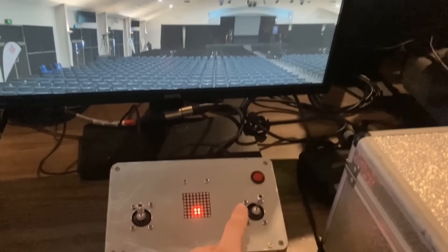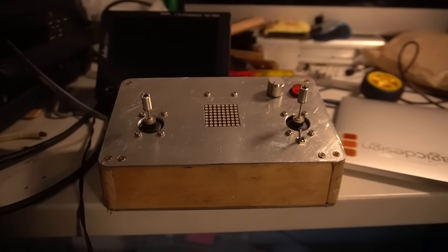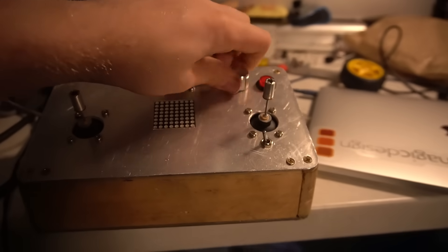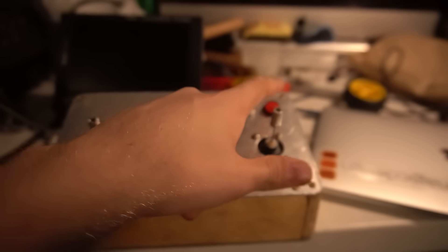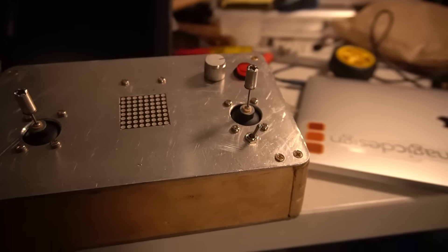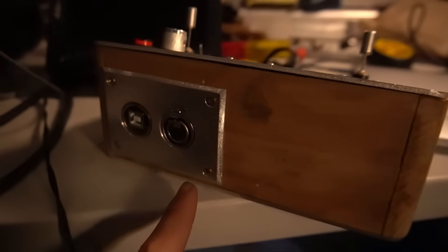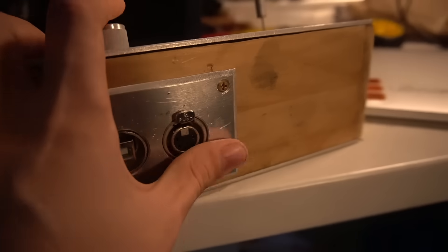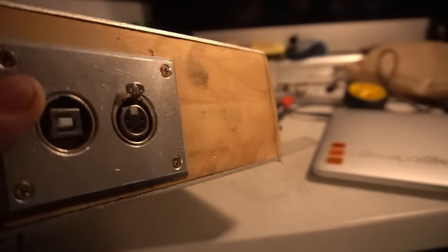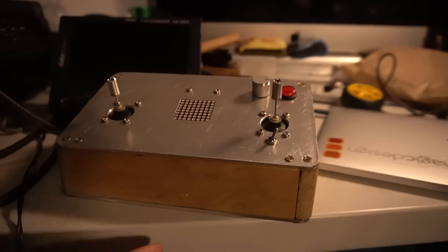So how did I find this out? Well, I went and took it out for testing and it went surprisingly well, but there were definitely some problems. So I spent the next two weeks designing and revising all the features it would need to have, and I came up with this. Here's the new control box. You've got your pan and tilt, you've got your zoom, here's your preset knob which selects the preset — press and hold to save, press once to recall. You've got fast, medium, and slow speeds. You've got your DMX 5-pin on the back and USB Type-B so you can actually program it. And your screen that tells you where you are.